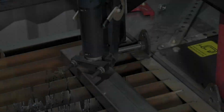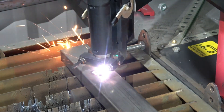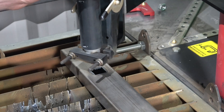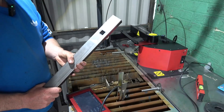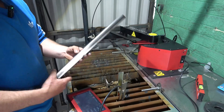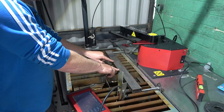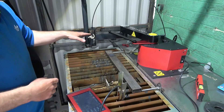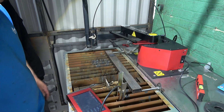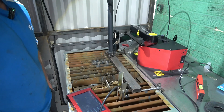So there it is - now we're going to cut that square in the middle, 100mm from the end. That side's cut out. So basically now I've moved the torch away - which doesn't matter. Simply turn it over, put it back in the jig, make sure it's all lined up like that. Now it's still targeted for that center hole, so it will cut in there.